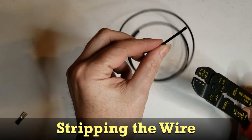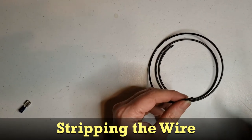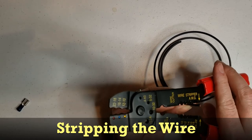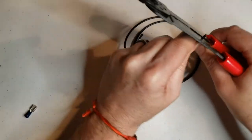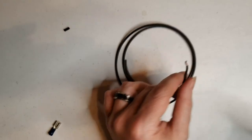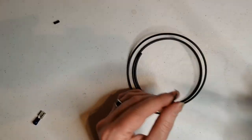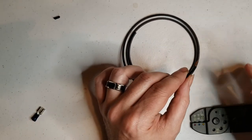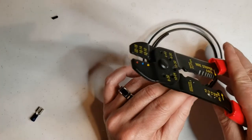For the black wire, or negative, you want to strip off the insulation. I always go about halfway, and you always go away from you. I want the strip twice as long as a short pull. If you do it in one long pull, you've got to take that much off at the same time, and it's harder to get it off the wire. Good tip.